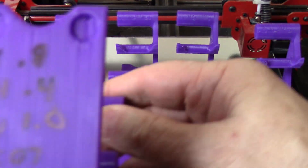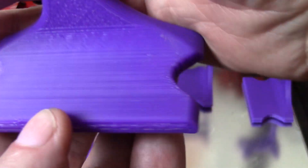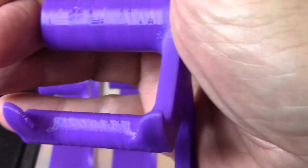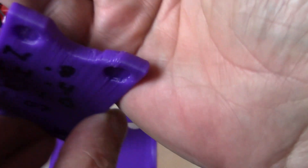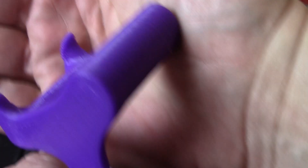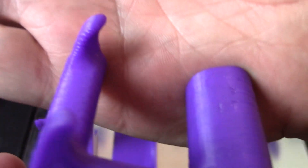This is the 0.8 nozzle at a 0.4 layer height and a line width of 1mm. It took an hour and seven minutes to print, and as you can see it is pretty rough looking. Is it acceptable? For what it is — a watch stand — the answer is yes, barely. You can see some rough points, especially in the curves, but it's acceptable for what I'm using it for.